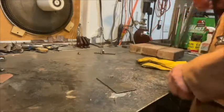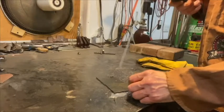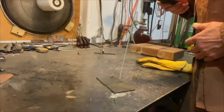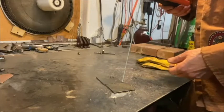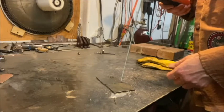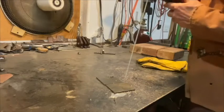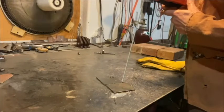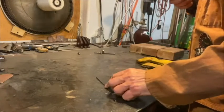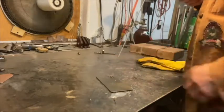When I bring this over, I'll have gloves on and a helmet on. What I'm going to do is tap down and lift up to make a connection when it's on. If I tap down, bounce back up, and hold it steady, I get an arc that I can then maintain. If I'm doing a couple of tack welds, I might just go one, two, three there and lift up — that'll disconnect the arc. I'll do a little tack weld there and a little tack weld there, then chip away that slag that's protecting the molten metal — burning off, melting on, and pushing the oxygen away.